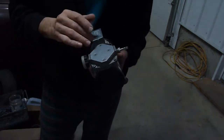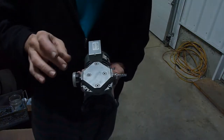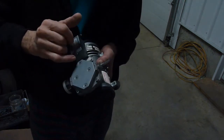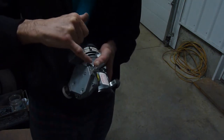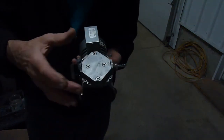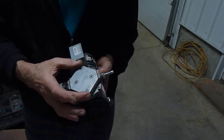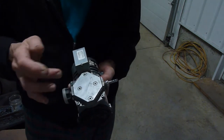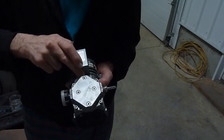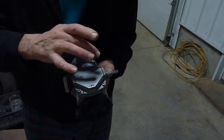When taking anything apart that has a plate, head, or some kind of assembly that's bolted together — this particular one only has four and four — these are two separate plates. These screws hold the head on; these screws hold the valve plate on, or the cover for the chamber. Anytime you're taking apart anything like this, start furthest from the center, loosen those slightly, then work inward. If there were eight, that would be the pattern — start on the outside, go across in a diagonal pattern.